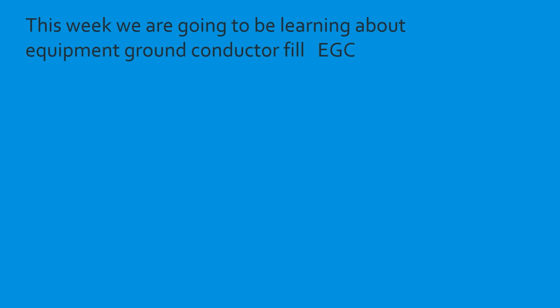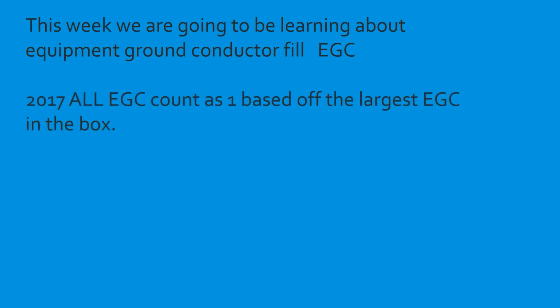All right, y'all, this week we're going to be learning about equipment ground conductor fill. You guys are in the Master Series. You know that the equipment grounding conductor is the EGC. So I may refer to it as that as we go through. So it's very simple in the 2017 and previous. And then when we get to the 2020, as far as counting the equipment grounding conductor for box fill purposes, it gets a little convoluted. And by the end of this video, I believe you'll be on the same boat as I am, as I don't know why they messed with it, and hopefully by the 2023 code, they will have changed it back.